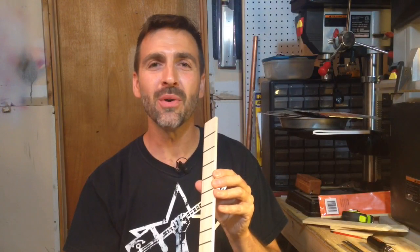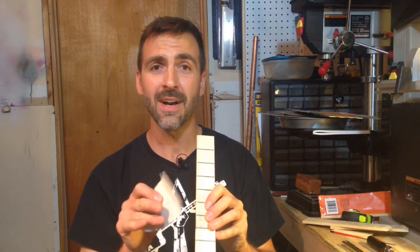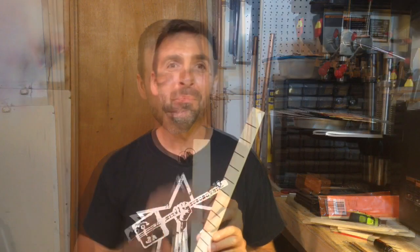At this point, go ahead and run your fingers up and down the sides of the fretboard. If you find anything still rough, you can go back and file it again. But if you're comfortable with your work, you can use that 220 grit sandpaper to just buff up the sides of the fret ends. Bada bing! There you have it — you're the proud owner of a fretboard. If you have any questions or concerns, please feel free to contact me at glenn at glennwatt.com. Check out where I celebrate the cigar box guitar at glennwatt.com. And until the next time, see ya!